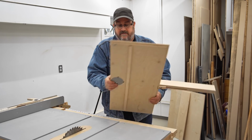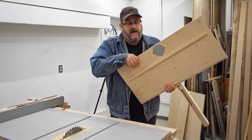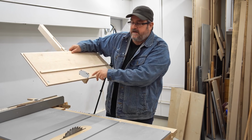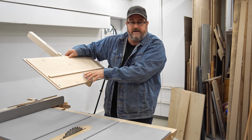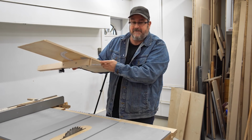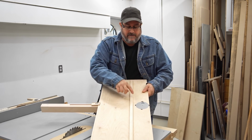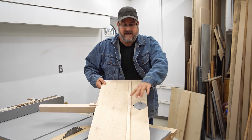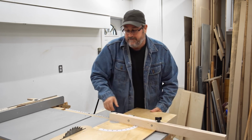I really have to take this strip off the back, because you can see here that the thing is almost coming through the edge. And because I was a little bit sloppy making this, I had to glue in some washers in here to pad that down, because I cut that thing too deep, either in the plate here or in the sled base. I just glued in those washers and actually cut through the edge of the washer right there on my first cut. So really this strip should be closer here, but then it kind of gets in the way, because that's the other thing I was thinking about. Is it going to get in the way of this plate as it rotates? So there are a few things that I have to refine and work out.